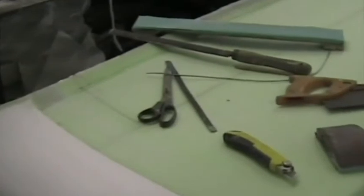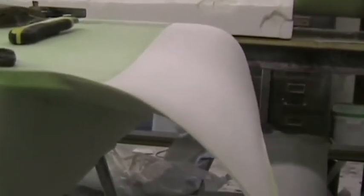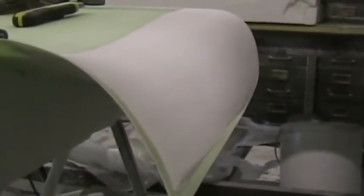Here's the other tip. And there are the various tools that I use to shape the wing tip. There's a front view to get an idea of the shape I've used. And a view from behind the other tip. I'm now going to apply the two layers of 190 gram glass at 45 degrees, same as for the top surface. With the wing inverted like this, I've now trued up the trailing edge with a long straight sanding block to the correct dimension. And now I've put micro in this recess at the trailing edge and I'm about to spline it smooth.